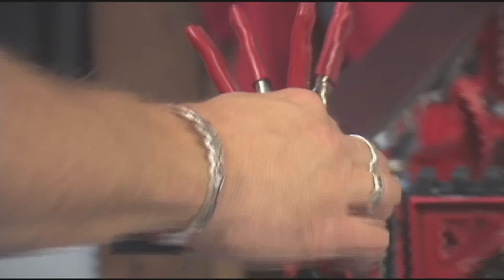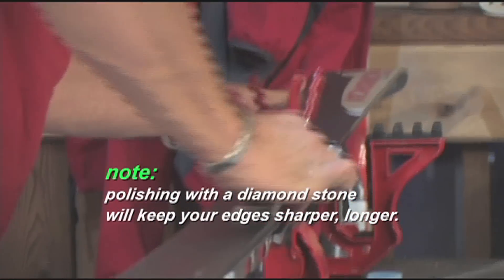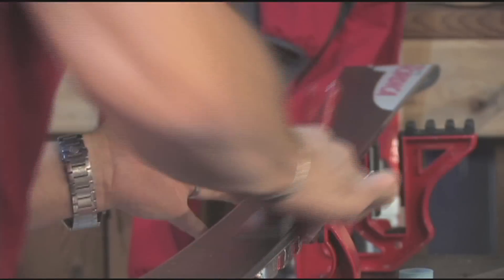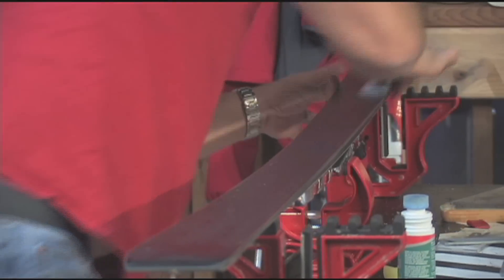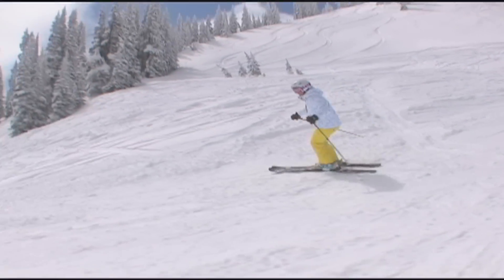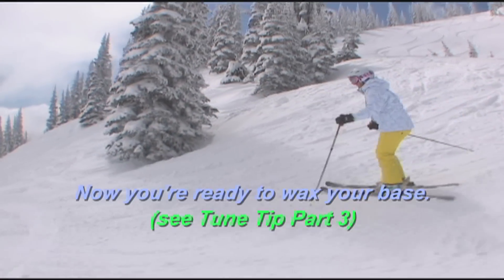What a diamond stone does is it polishes that edge, keeps it sharper, keeps it harder. This is something that I definitely do in both directions because it's a very smooth polish and it just allows you to get a harder base on there. We're not pushing too hard, but we're going through and just making sure that that edge is as razor sharp as possible. This is what counts — this is what really polishes that edge and keeps it sharp longer.